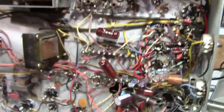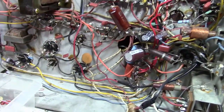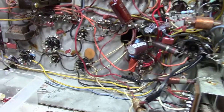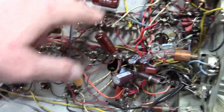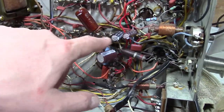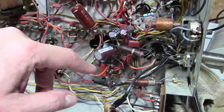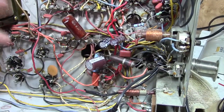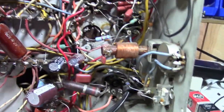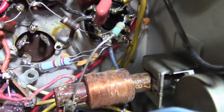But getting ahead of myself, just slow, steady sweep across the bottom here. Then I'll work my way up. So far, no more surprises. I have pretty well gone through this, and everything that looked a little bit odd to me, I double-checked. All the caps do seem to be the correct value, more or less, and they're hooked into the right place. So I'm hoping there won't be any surprises as I'm seeing more ceramic caps down in there. Although that does say NPO.